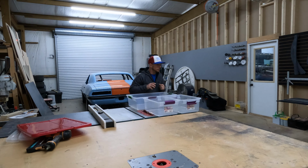And we gotta do a little math to see how tall we need the sides to be. So we're gonna have to figure out how far it is between each shelf and then allow the thickness of this shelf in there so that we can properly slide these in there. So I believe how we're gonna do that is we're gonna set the bins out right here on this flat table saw. I'm gonna take my shelf stock here and I'm gonna set it on top of there. Now the table saw is gonna act as the shelf underneath. This will act as the shelf above.